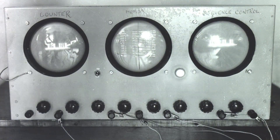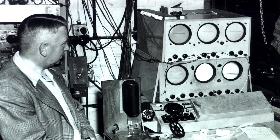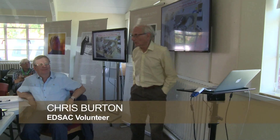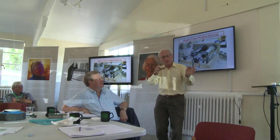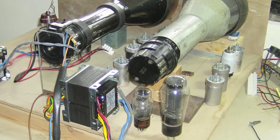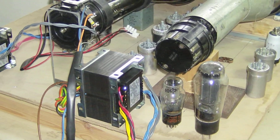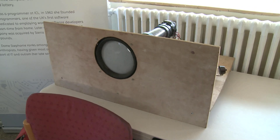The next thing is Chris on the display unit. You'll remember from the last presentation, I brought out endless photographs of the boxes. To the first order, all you can see is what the boxes look like on the outside. So extrapolating to what it's like on the inside, knowing the size of the box by scaling — it's as big as that. The idea of making that was so I could lay things out and see where all the valves and the variable potentiometers and the rest of it fit in, including the mains transformers and the power supply. I brought it along as a reality check.